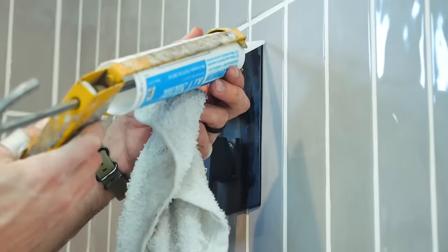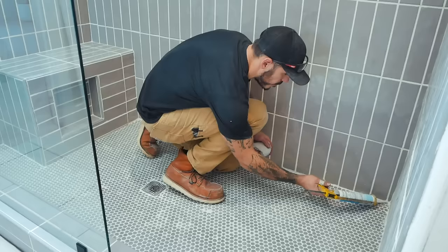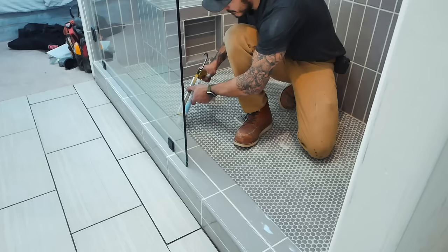Silicone — one of the last steps in waterproofing. They recommend running a bead of waterproofing silicone down at the bottom of the shower pan to give one more layer of added protection in case the grout cracks and water starts breaking down the materials.